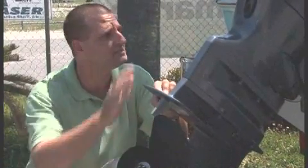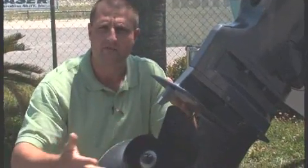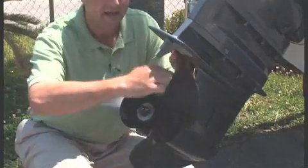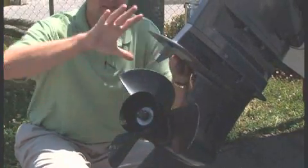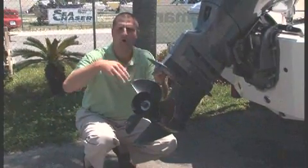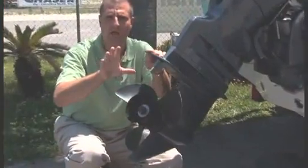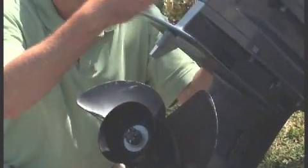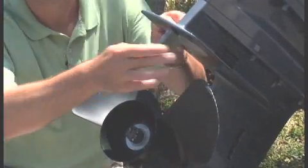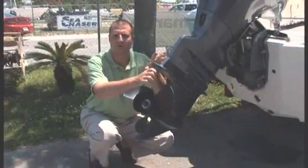Second, because this is a single outboard configuration, your outboard will create a factor called P-factor. You may have heard that as an airplane terminology, but a propeller on a boat, much like a propeller on an airplane, is turning one way — which means it's giving unusual forces in the opposite direction, meaning the motor always wants to go to the right because this is a right-hand rotation. This little trim tab will take that pressure and help the motor stay aligned at all times, running in a straight line, which is exactly what we want unless we want to turn. So two important factors: one, it's protecting against electrolysis; two, it helps keep your outboard running straight.